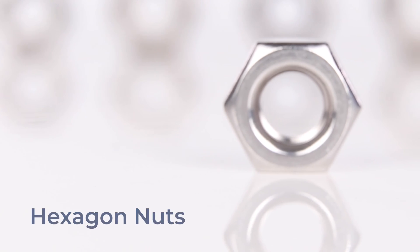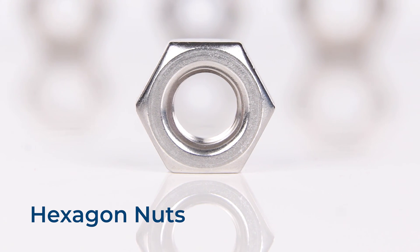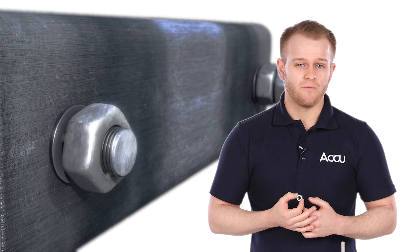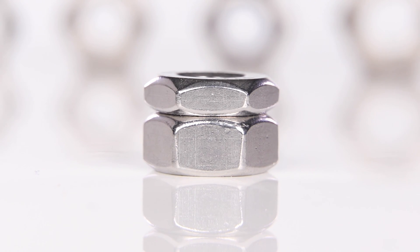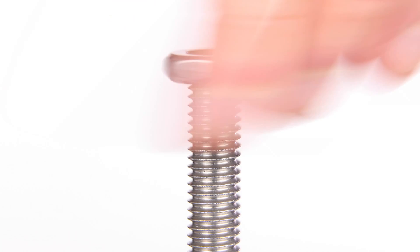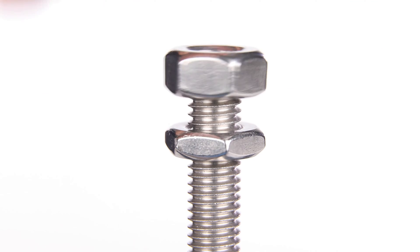But first, let's take a brief look at the everyday standard hexagon nut. We all know that the hex nut is a low-cost fastening solution, and its versatility makes it suitable for a wide range of applications, but when it comes to harsh vibrations which cause loosening, it's probably not your best option. Having said that, there is a method of using two nuts to prevent self-loosening. Along with a regular hex nut like this one, there are also thin nuts, which are sometimes called half nuts, owing to them being roughly half the height of a standard nut. When a thin nut is jammed up against a standard nut, it forms a basic lock nut solution. Unsurprisingly, this is called a jam nut.